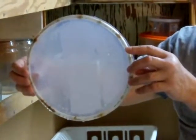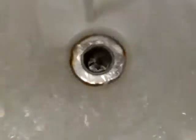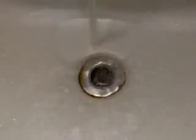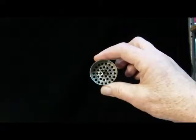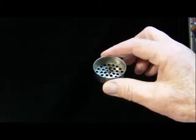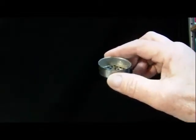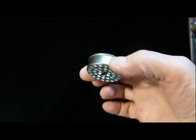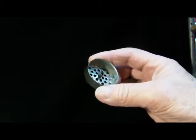So how does this relate to the drain, where water is not static but flowing rapidly? The water is turbulent, and much of the flow is across the surface of the holes, rather than straight down into them. The water clings to itself, jumping over the air gap, just as the drops on the underside of the lid can ignore gravity. A drain guard comprising vertical tubes instead of holes would have the same effect as turning the lid on its side to give the water a downward path to cling to. Such a drain guard is easy to make for practically no cost, from the corrugated plastic used for lawn signs.